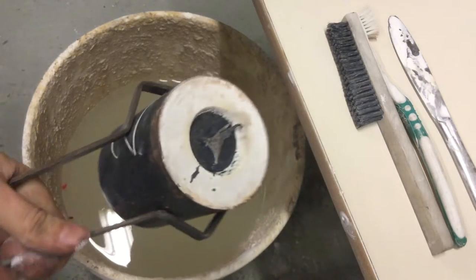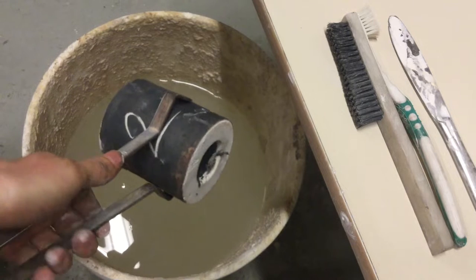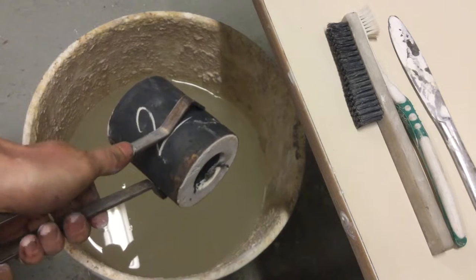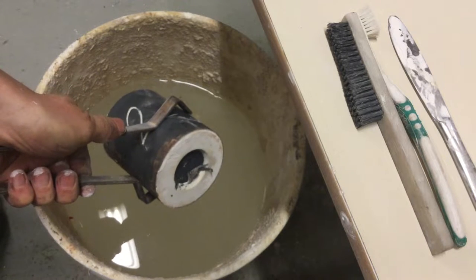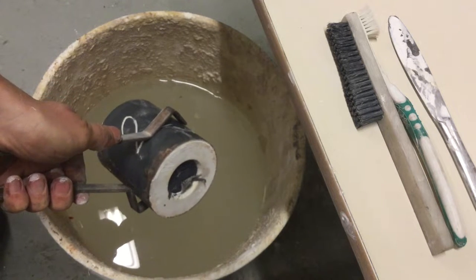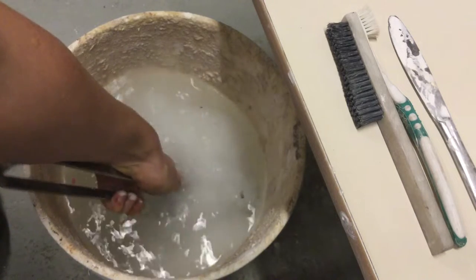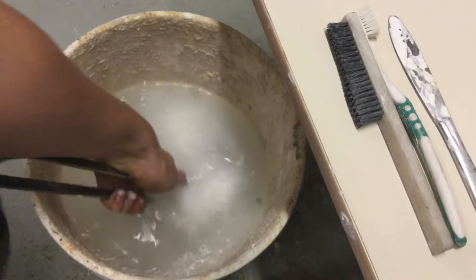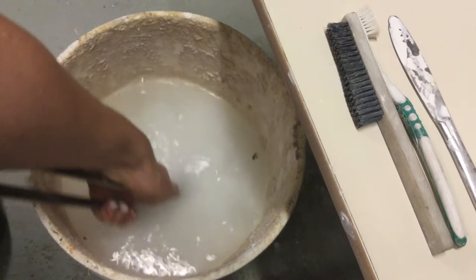So we're going to quench it under the water — sideways, fully — to make sure that the plaster violently erupts in a pyroclastic cloud of debris. But we don't want to breathe any of that, so it must go all the way under. This will boil the plaster out of your part, saving you a whole bunch of time chipping through the plaster to get to your final part.